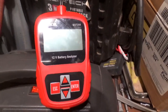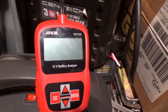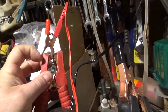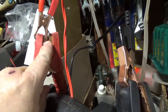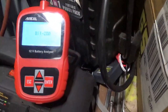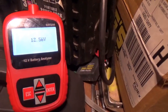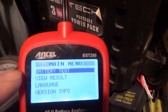There is a better way. After Sean's video he had the blue charger and this 12-volt battery analyzer together. Let me show you how that works. It is clipped onto the battery and does a four-wire measurement — you have to get that little copper block and the outside of the clamp both connected to the terminal. Turn it on and it's telling me 12.56 volts. Hit enter and it says battery test.